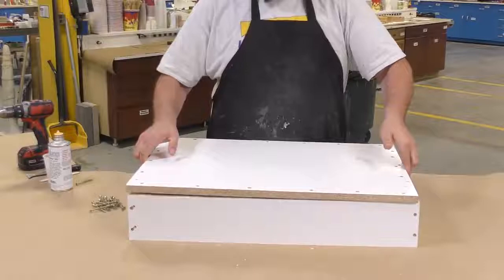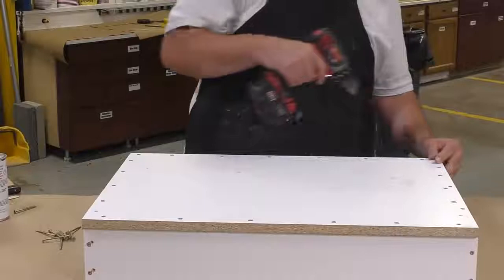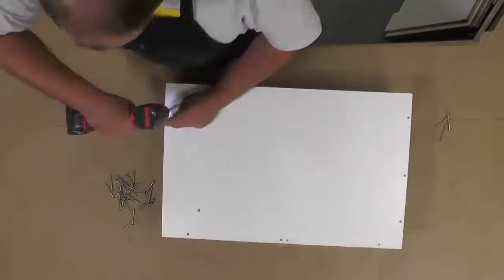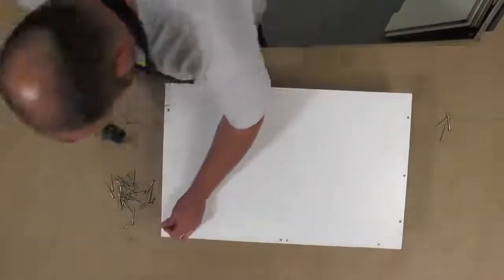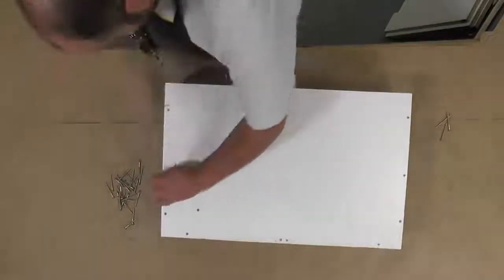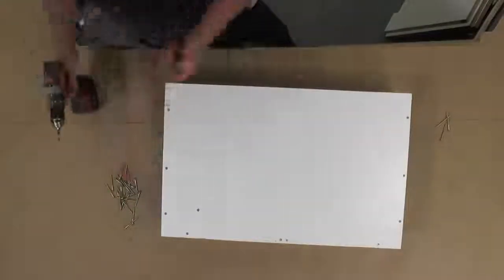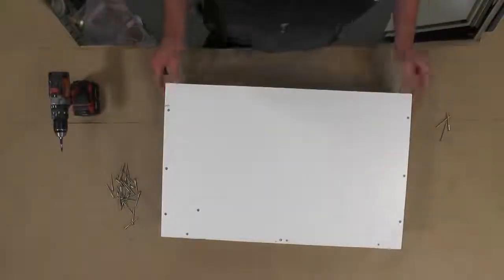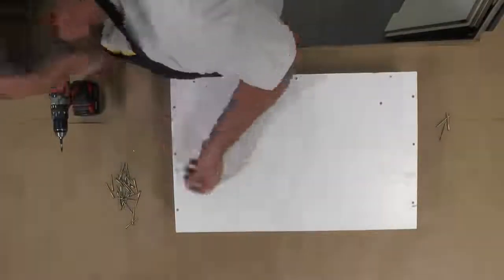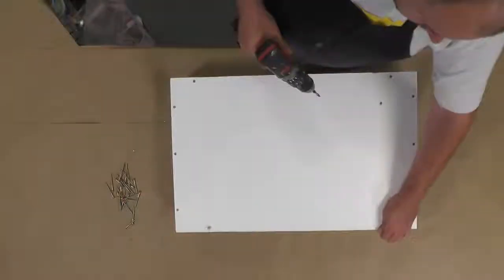Now, the basic formula for placing of the vents will depend on the size of the mold, but usually it's best to place the vents along the edges of the mold, where they're going to make sure that the casting inside the mold box has fully filled with material. Fewer vents allow more back pressure and a better finish on the parts, but again, keep in mind that there is that possibility of the pressure breaking the mold box. So you may need to adjust your vent placement and vent quantity.